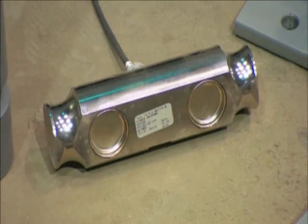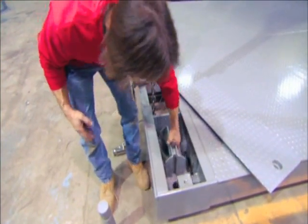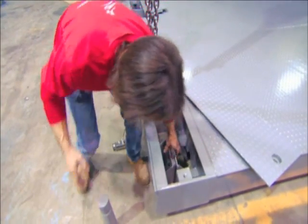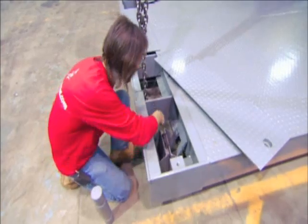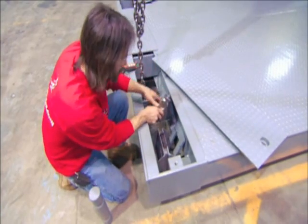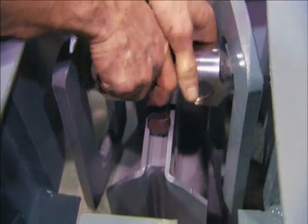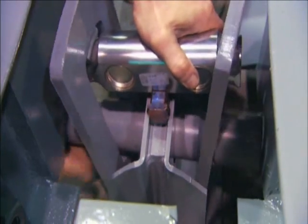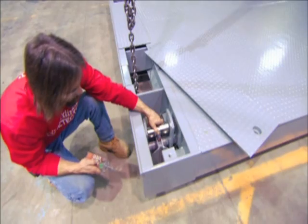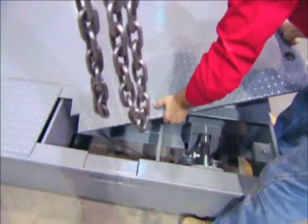Now that all the parts are ready, final assembly of the truck scale can begin. The weigh bridge, right side up now, contains eight load cells at different locations. The first step is to install each load cell stand into its respective position. They insert a link on each side of the stand, then position the load cell at the top of the links and the bulkhead pin at the bottom. Then they close up the location with an access plate.